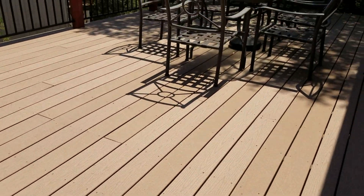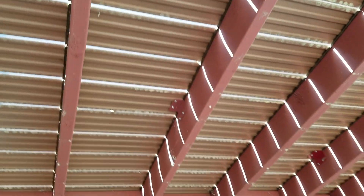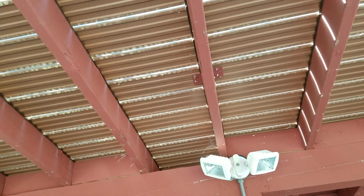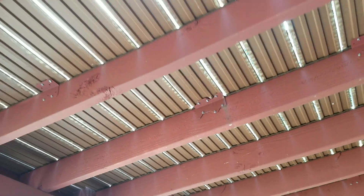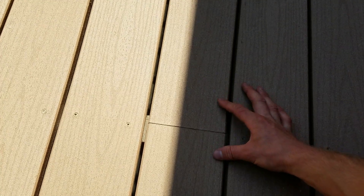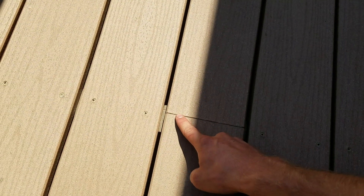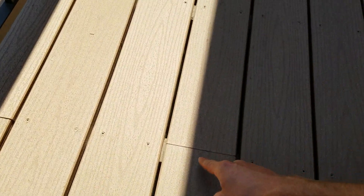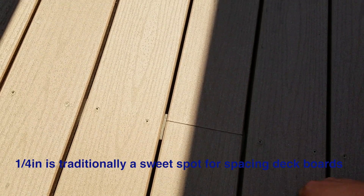Here's a nice example of staggering your boards with composite wood, but that will make you put braces underneath every single one that you're butt joining. You can see it's super tight and you have to get both sides on each joist, then put the bracket underneath and tighten it. There's a big issue — it starts coming up. If you don't leave a big enough gap, you'll get buckling, but if you leave too big of a gap, it won't be fully on the joist and will be a little bit weaker.